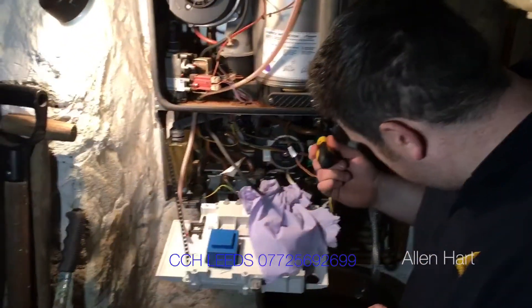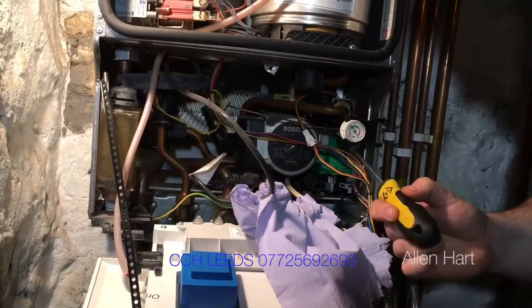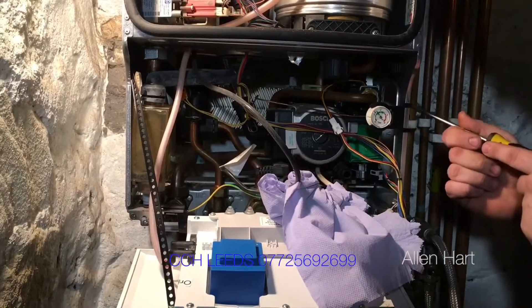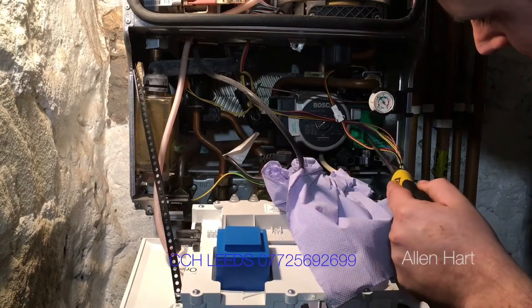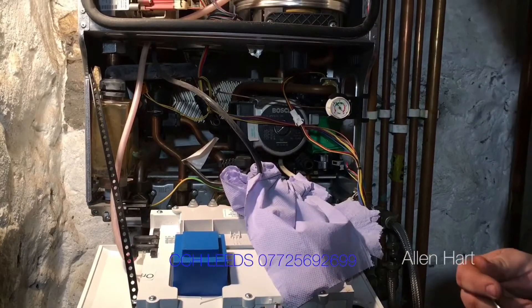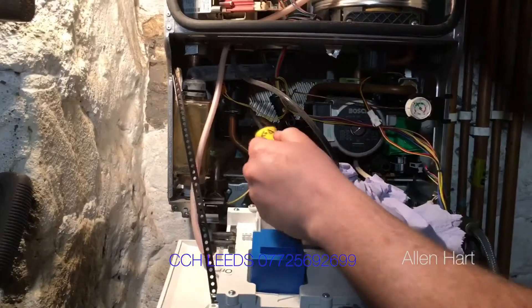I'm Michael Mackie and today I'll be fixing the flow type turbine spigot adapter on the back of the Worcester flow turbine. It's a common fault — either this part leaks here on the right and you'll see it dripping. You can fault Worcester for this because rather than make this out of something decent like brass, they decided to put this rubber jacket over here. On the earlier models it didn't have this and it used to take out the divertor motor.